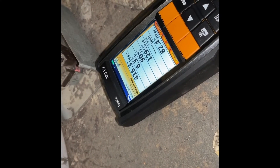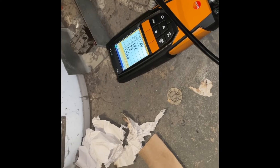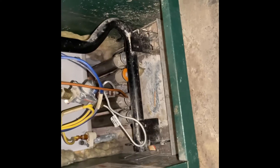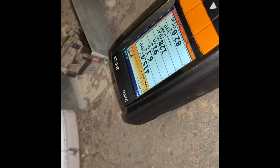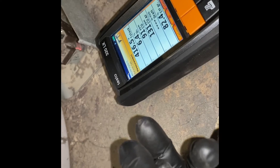You need the right tools - you should know how to adjust the gas valve. I'm going to crank this down a little bit more - my CO is creeping. Check the flame. Alright, 6.2 - I don't think I'm going to be able to get this down any lower. I'd like to get that CO under 50, but I'm going to have too little gas pressure going through there. This Williamson 70k BTU - stack temperature will have it on the high side.